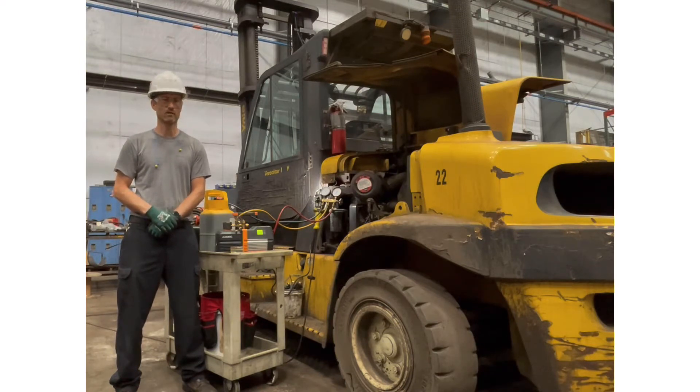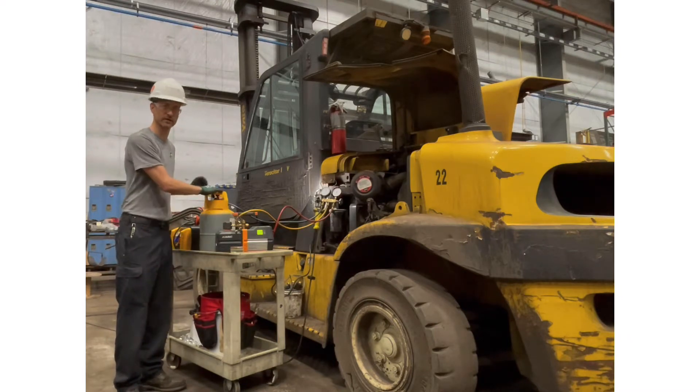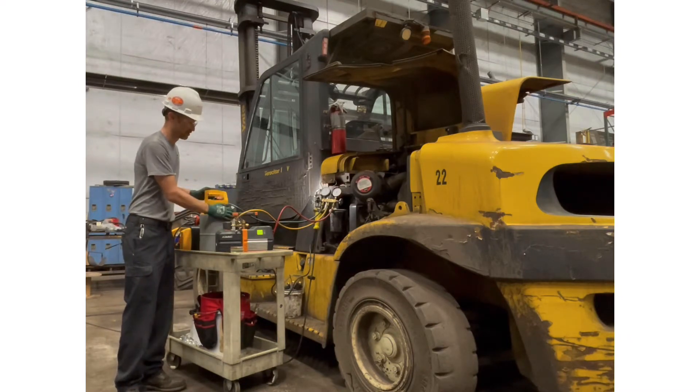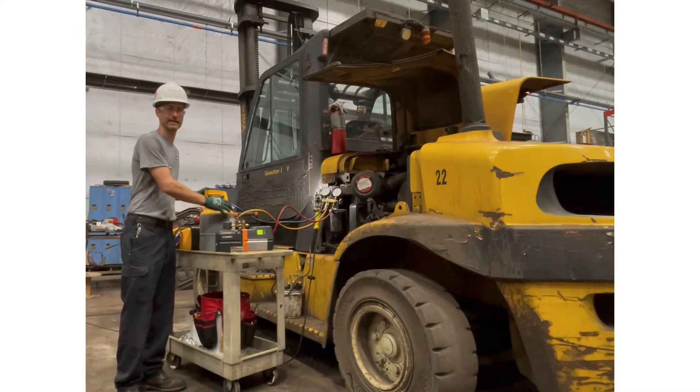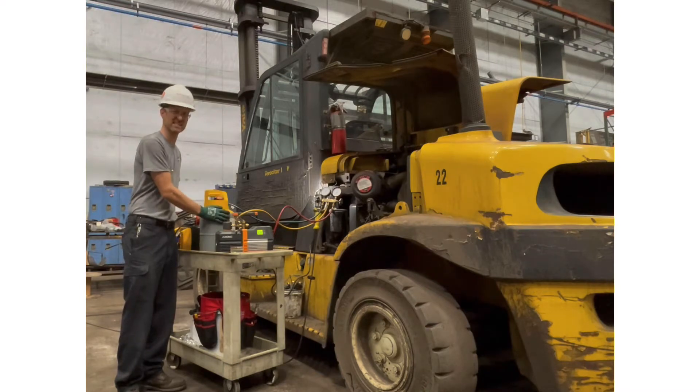Make yourself aware of the equipment, safety, and how to work on it. It's all relatively the same — just different applications. I will be pulling a vacuum currently with my vacuum pump, making this recovery cylinder clean and dry and in a vacuum to remove any contaminants and moisture. I'm going to pull out the refrigerant from inside the system and put it all inside here.